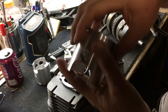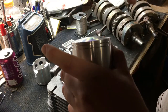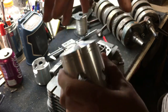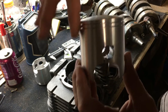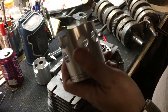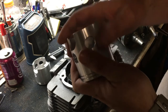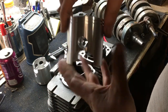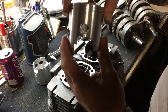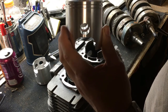The head, being so thick, expands more slowly and proportionally to the skirt. They've also factored in that the only contact points on a running piston are really the skirt and the piston rings. You want to get it tight enough that when it wears in it's in spec after honing, but not too loose — if this piston slaps, you'll never forget the sound. It's like someone shaking a box of marbles.